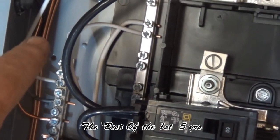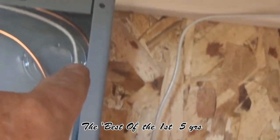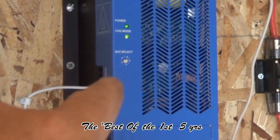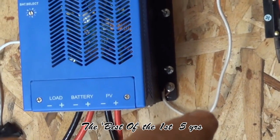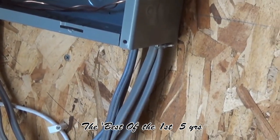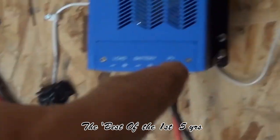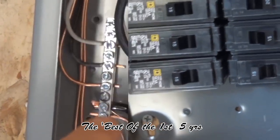On here I have a white wire. The reason why I have a white is because that white one is going around and it's going over here to my charge controller — it's actually grounding the box of my charge controller. The reason I use white: this is 10-gauge wire. I pulled it straight from one of these; I had leftover 10-2 wire, so I just pulled out this wire, left it covered, and I wanted to use white to identify that as my charge controller ground.